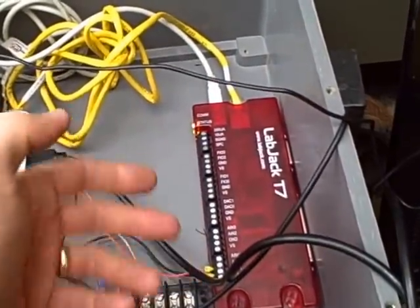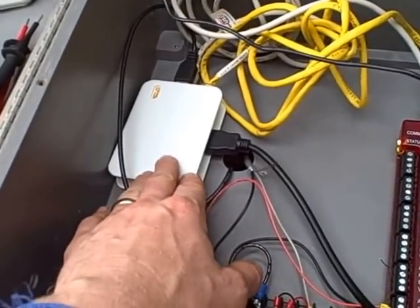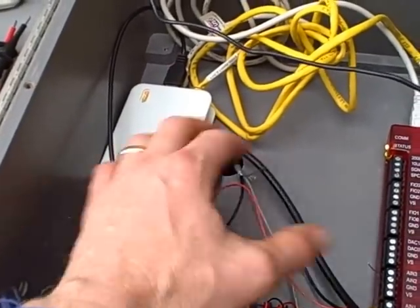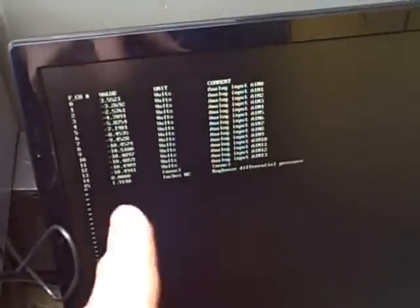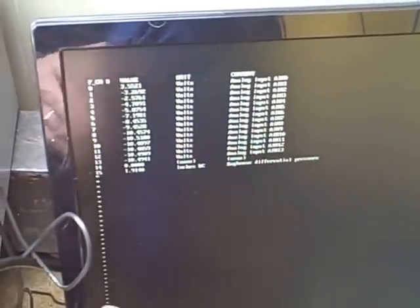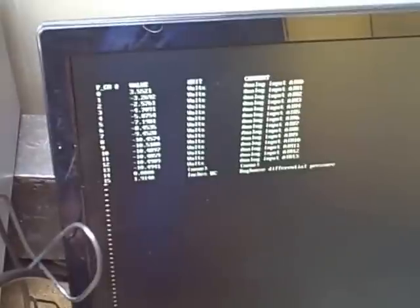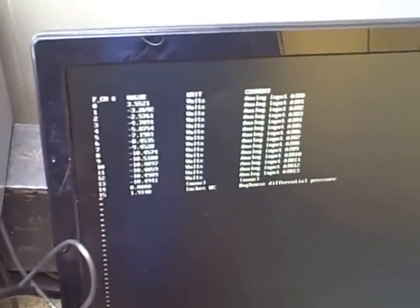Like I said, very crude setup here. We will be permanently installing this later on using the LabJack units, talking Modbus protocol over Ethernet, using the Raspberry Pi computers running the Linux operating system and my own code that's going to acquire the data and present it in a form that is readable with units of measurement, comments, and all that. The purpose of this is to have students actually do some coding in the C language — they are going to be taking the code that I wrote and modifying it to scale, comment, and label with units all the variables they're assigned to measure. I'm going to use my basic software by modifying the functions to condition each signal channel according to the application they have. It should be a very flexible system.